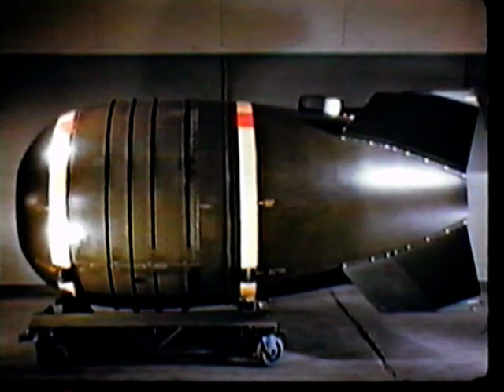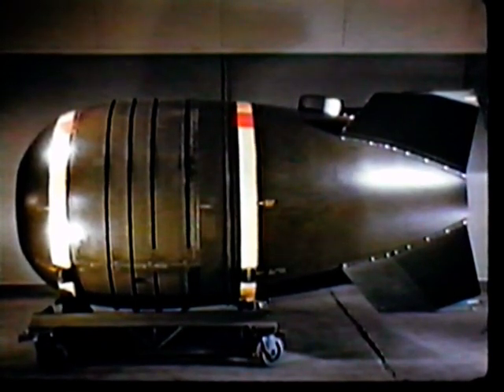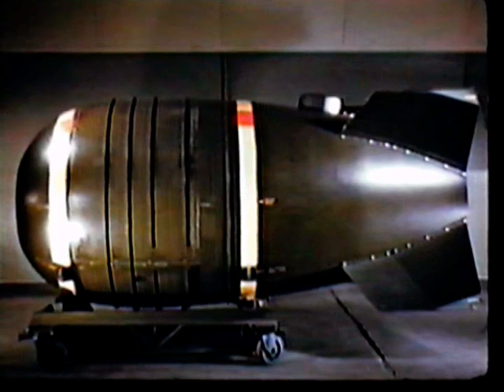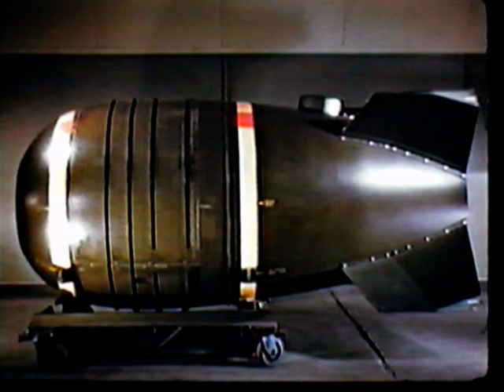The Mark VI looks almost identical to the Mark IV from which it was developed. But inside the 61 by 128-inch aluminum case, many changes have been made. Below the safing plugs, an easy-to-remove nose plate permits access to the horn-type radar antenna and allows for simpler and quicker in-flight insertion. Redesign of the entrance to the pit, addition of a detonator-holding trap door, and coring of the high explosive makes it possible to slide the outer and inner cores of HE into a rotatable holder and permits manual IFI to be accomplished in a minimum of time.